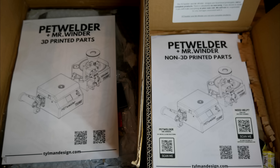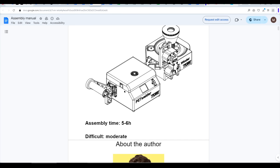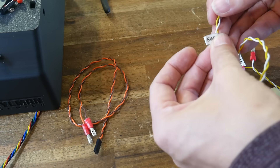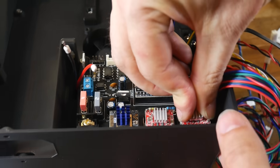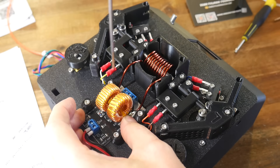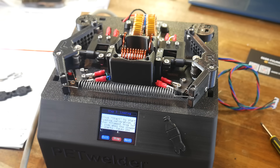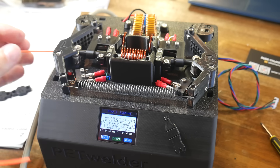This product is another kit build, and again I was using supplied printed parts. Again, we have a comprehensive manual — this one currently 143 pages — with an assembly time of 5 to 6 hours. If you hate wiring, the good news is all of the looms this time are pre-made. So the most you'll have to do is apply labels as per the directions, follow some steps for cable management, and follow a diagram to plug everything correctly into the main board. Apart from that, it's mostly just bolting things together, but it has to be said this is a complex machine with many small moving parts and some calibration that needs to be performed precisely at the end of the build. That said, if you're used to building and tinkering with 3D printers, you probably won't have any issues.